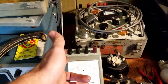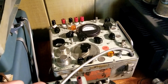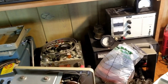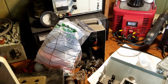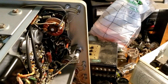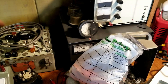Got a couple of voltmeters. This is just a DC voltmeter. This is a military capacitor tester. I got this because it'll actually test capacitors to their working voltage — it's got a power supply in it that will go up to about 500 volts for testing capacitors. When you're testing old vintage capacitors, you really want to do an at-load test to make sure they have capacitance. A lot of them on tube equipment are running in the 450 to 600 volt range. They don't make regular power supplies for that, so it's a really nice tester to have. And it's working just fine.